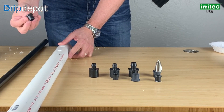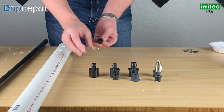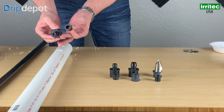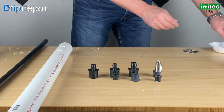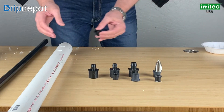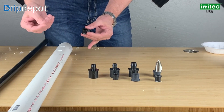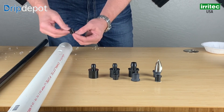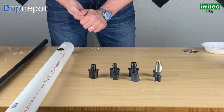Now to properly install it — mostly it's a rubber grommet with a plastic fitting, and there's a lot of bite there. So what we like to do is take a little bit of soapy water. Or if you have a gasket of pipe that you're gasketing together and you have the gasket lubrication, stick a little bit of lube down there — that's fine. You can feel how tight the tolerance is as it goes in.